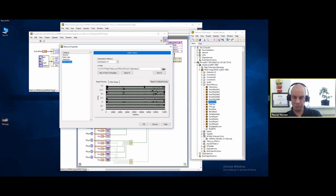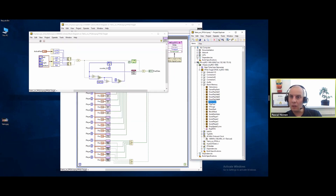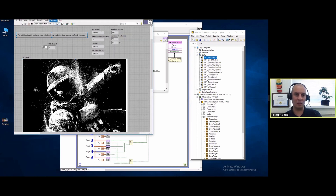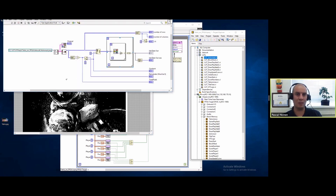To store this data, you have to make a VI that basically outputs the data of the astronaut image. These are my lookup tables for the initial values of all the block memories. I have one for the astronaut. If you run it, it basically loads a PNG image and formats it so it can be stored in block memory as an initial value. You have to provide some extra information and do some programming, but it loads the PNG into memory and loops to put four pixels in one fixed point value, then outputs the initial data stored into block RAM.